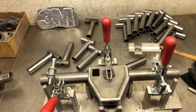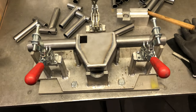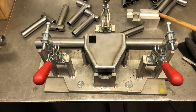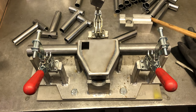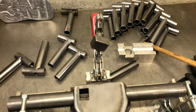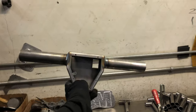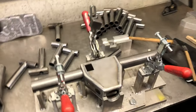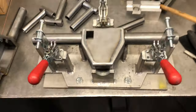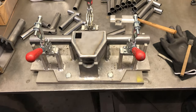Just so you guys get an idea — if you ever want to build a jig, it's super simple. All you need is a part. Make one of the part you're building, then you can build the jig around it. Then you have a jig for that part. It helps for production, keeps everything consistent — everything straight, 90 degrees, proper angles. Welding jigs are super valuable, and building one is not that hard.